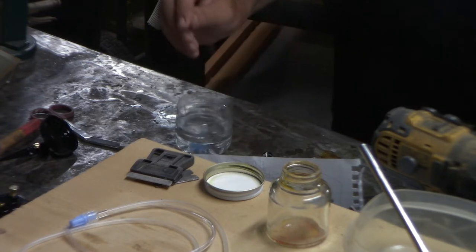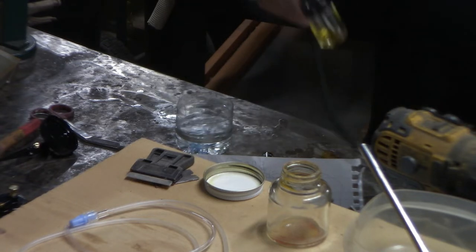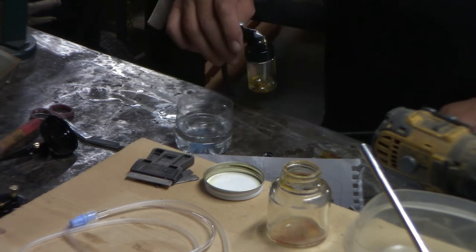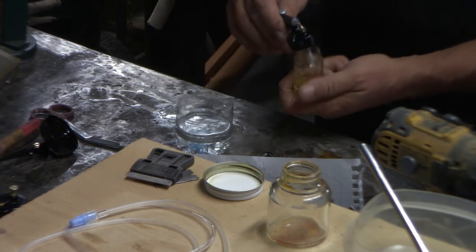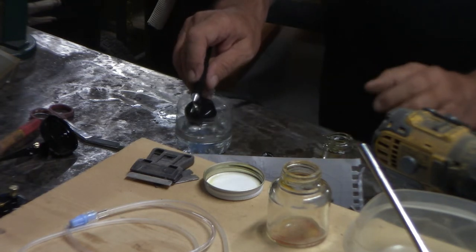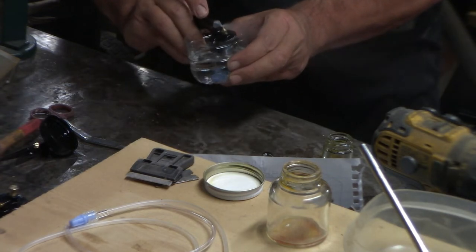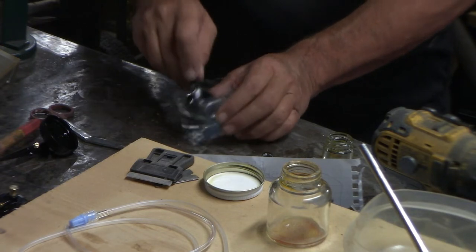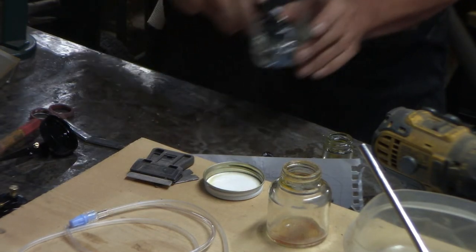Okay, so I get my spray gun. Right here. Let's see. I get the spray gun, I unscrew it. I just set the tip into there and press it and hold it up out of the way. And I run that lacquer thinner through there. Now, I dip this whole thing up to the tip in there just to get everything good and cleaned off.